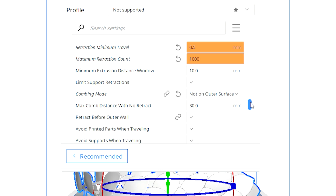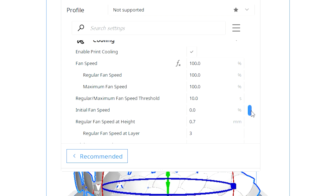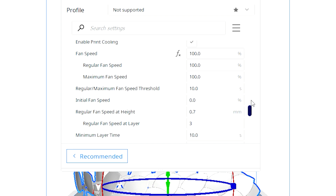For cooling, if you leave it alone it'll go to 255 speed. I set it at 100. Using your fan too much will dry the filament quicker, causing bunching problems — so it either strings or bunches.